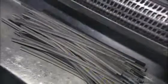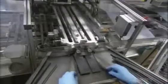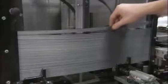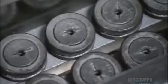The blades go through a spray of graphite to reduce friction, then drop onto a grate to dry out. The rubber is so smooth it's hard to grasp, so workers must insert each blade by hand into an assembling machine. In the center of the wiper blade is an opening into which a machine will insert a metal tension strip. It serves to press the blade against the windshield and hold its shape. The machine applies pneumatic pressure to literally blow the strips through the length of the blades.